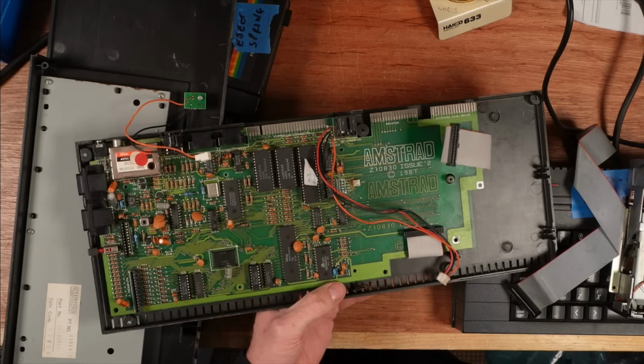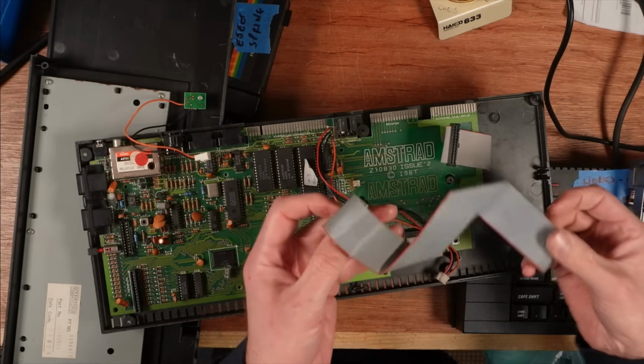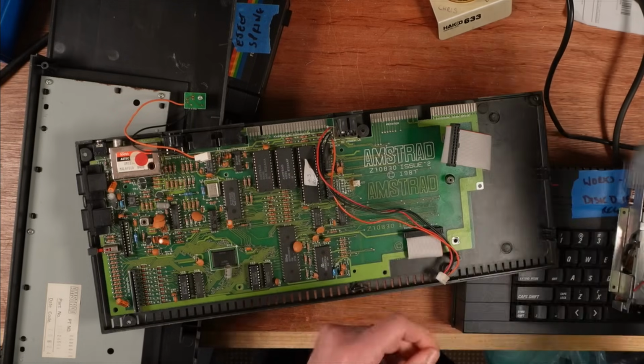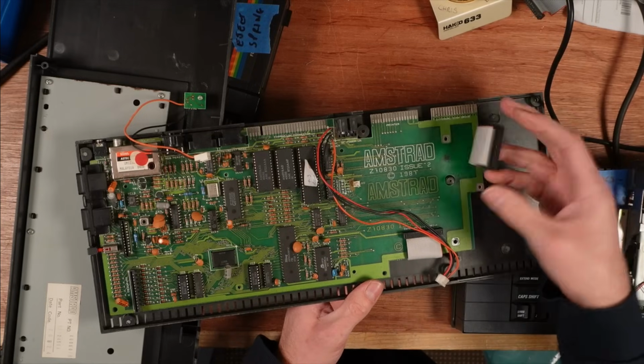The only other thing that I had to do was on this machine here, the floppy drive belt fell apart, the back clip just broke off, so I salvaged one from the spare board and cleaned it up, and that one works fine. So I'm putting these ZX Spectrum +3s away for now until I've got the parts that I need to actually put a Gotek in one of these.